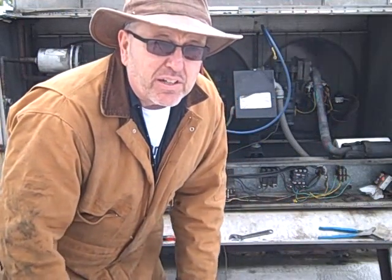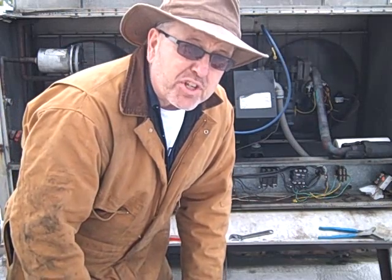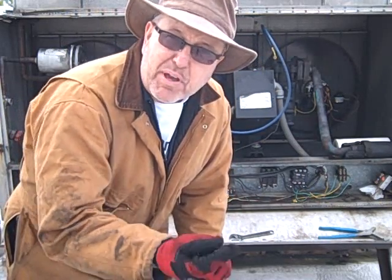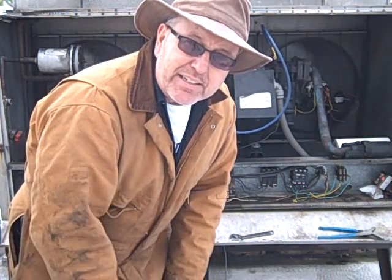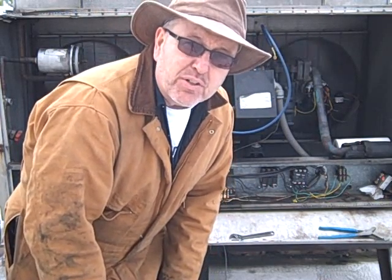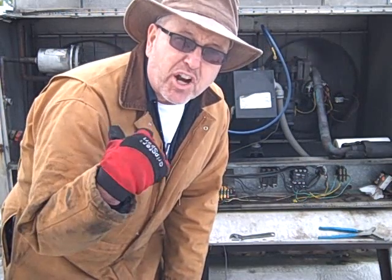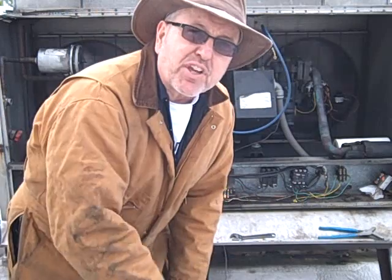The first thing I'm going to do is do my own pump down on it before I shut the power off. There's a pump down switch downstairs, but it's up behind the evaporator, behind the racking — almost impossible to get to. So instead of shutting that solenoid off, I'm going to shut off the high side up here and let it suck itself down.